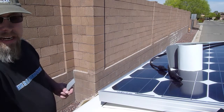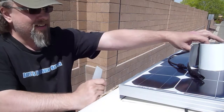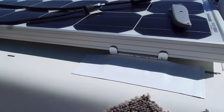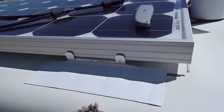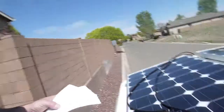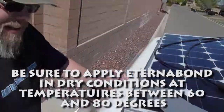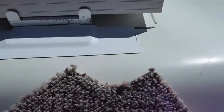Like I said, this is really simple stuff and I can't really give you a better handle because the roof is curved, so you're just going to have to kind of deal with it. I'm already getting gummy stuff on my solar panels. Basically like that. I mean it's still going to get wet — I really don't want to put silicone on the roof, and people say never use silicone. Anyway I got four strips for the outside. I'm just basically going to go ahead and plaster those down. That's the finalized product — just getting some of the air bubbles out. I just do that on each side and that is basically the weatherproofing for the VHB.